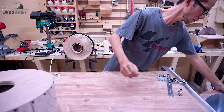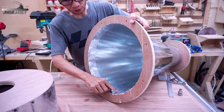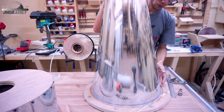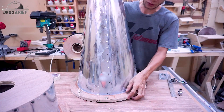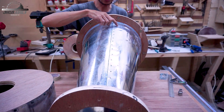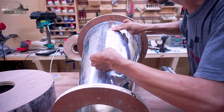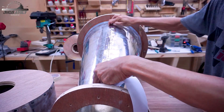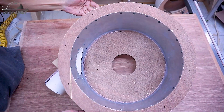I also add aluminum duct tape - this is aluminum tape - and I just cover all the joints, including this overlap joint where I already added silicone. I cover it with the aluminum tape. I know this looks like too much, using silicone and then covering it with aluminum tape, but I have all this material so I don't mind adding more shielding.